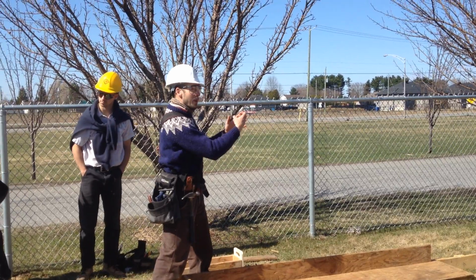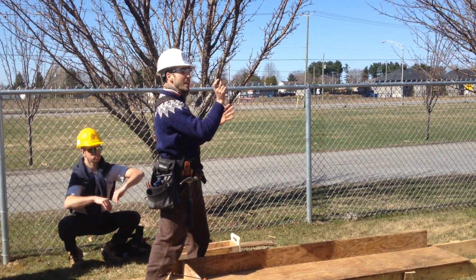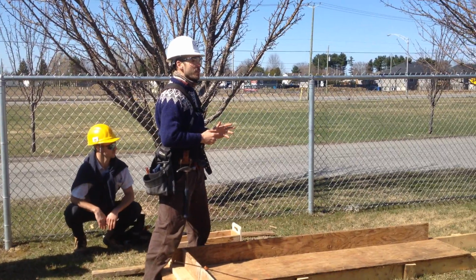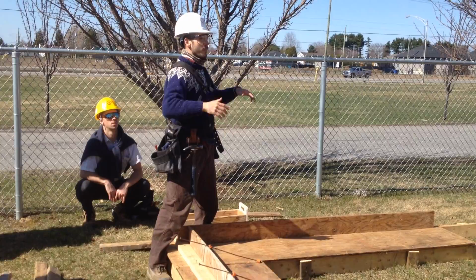And then they would put these little plastic spacers to prevent the steel from touching the form, so that we can have our 1.5 or 2 inches of space between rod and concrete. But it's another trade. And then they do all the steel work, we come again, and we close the form.